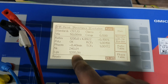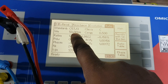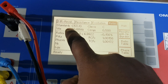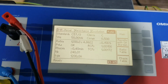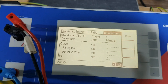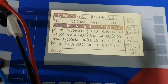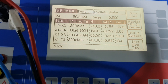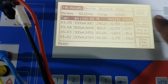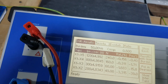See here - this is full tap 1200 by 5, polarity is okay, burden is 50, class is C, standard is as entered - everything is coming here. The assessment is all pass. You can also see everything individually. For CT ratio you can see results with burden - if you go inside, you can see burden individually for all phases.